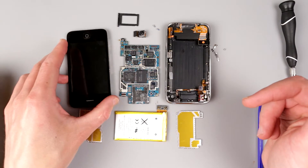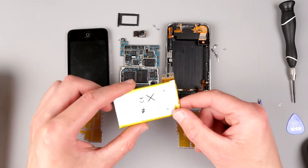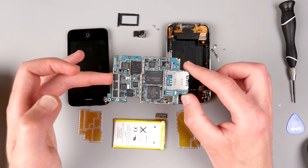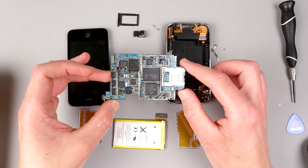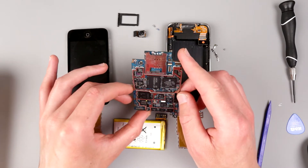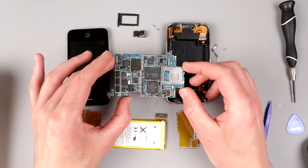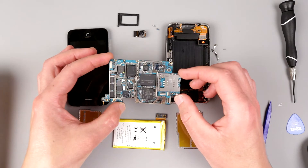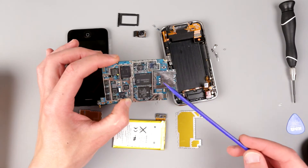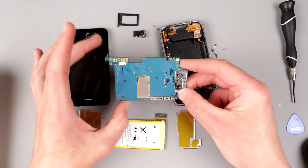Now let's just put it all together and see if it works. I'm still kind of not sure about this battery because it gives me 1.7 volts, which is too low for a single-cell LiPo, but whatever. Also, I could not resist and I pulled all the cans from the main board — I'm gonna share high-res images of this little and beautiful board, despite it being like a bazillion years old. The date code here — let me see — it's month 10 of 2010. It's 10/10, almost 10 years old, beautiful and still looking good. I'm obviously going to go over this board in detail and we may do some analysis to see what's interesting here. On the back side there's nothing else. Also gonna clean up all the crud off the camera of course.